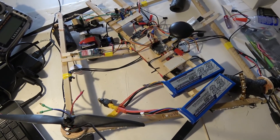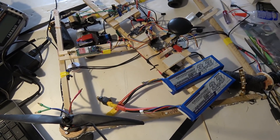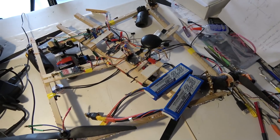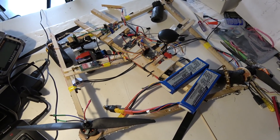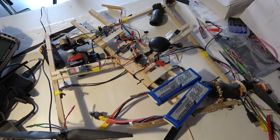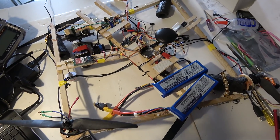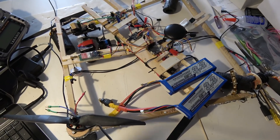When I flipped it into air mode I wasn't ready for that extra maneuverability, and it was all over the place. Not being a fast thinker, I forgot to flip the switch back — I could have gone GPS, which would have been a little risky, but I should have just gone back to angle mode and then I could have got control. But I didn't, and it crashed. I learned you shouldn't put air mode on unless you're some kind of mini quad expert. And lowering the P-gains really didn't help when I was in angle mode — when I lowered the P-gains it was worse, very unstable.